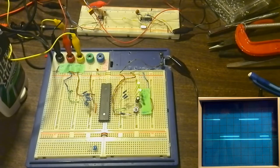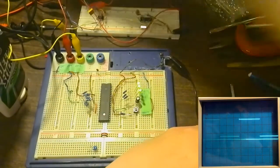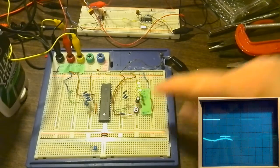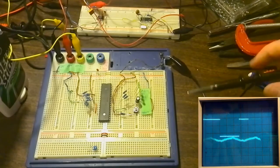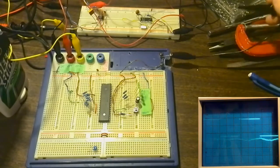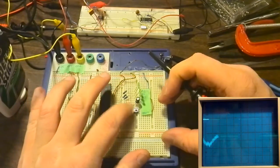Let me plug in my second channel. That was picking up 50 hertz interference. A gentleman named John Cunningham pointed me to a video that explains how to get around the probe problems. I basically looped a paper clip to act as a spring to short out that ring, but that'll be for a different video.